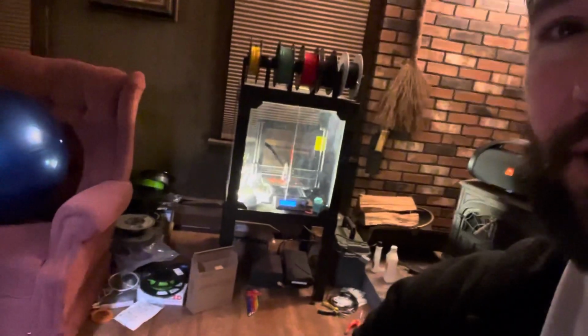I've got a lot of filament. I've run a lot of different filaments at work, but the two main filaments I run here are PLA and PETG. So PETG, I think, is a glycol modified PET. PET is a plastic you see really often in soda bottles. That's a great use of it and all over the place. A positive is it's very ultraviolet resistant. A lot of plastics break down when they're out in the sun. And it also has excellent creep strength, PETG does.